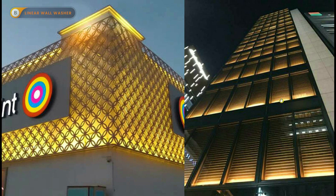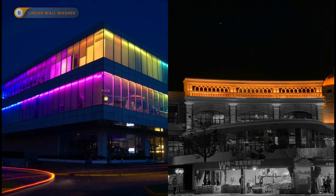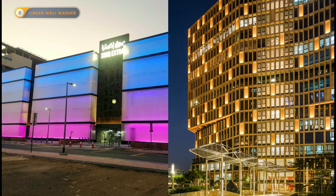There are a lot of wattage options, from 10 watt up to 100 watt wall washers. You can use, for example, 10 watt wall washers here, and for this kind of effect you can use around 48 to 60 watt wall washers. It depends on the client's requirement — how strong a brightness they want. Here you can see an indirect amber effect using maybe 24 watt wall washers. You can also use RGB wall washers for color effects. All these wall washers can be used in many ways depending on the project.